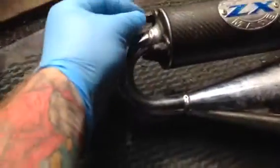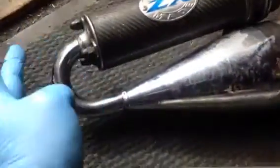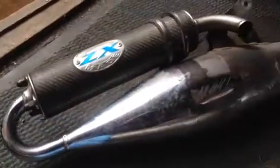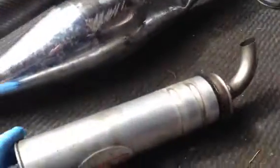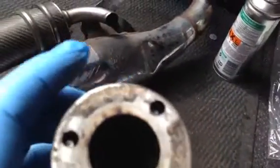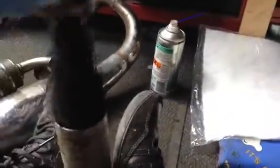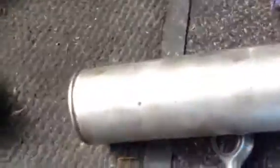Now, when you undo these, undo them right to the last bit, turn it back on and then get either a mallet or a hammer and tap individually very lightly. Sometimes they come off easy, sometimes they won't. Do not whack hell out of them without putting nuts on until you get to the last little bit where you've just popped through. Take them off and then gently tap them. If you didn't put the nuts back on and just whacked them, you can bend these or snap them — then you'll have a leak.